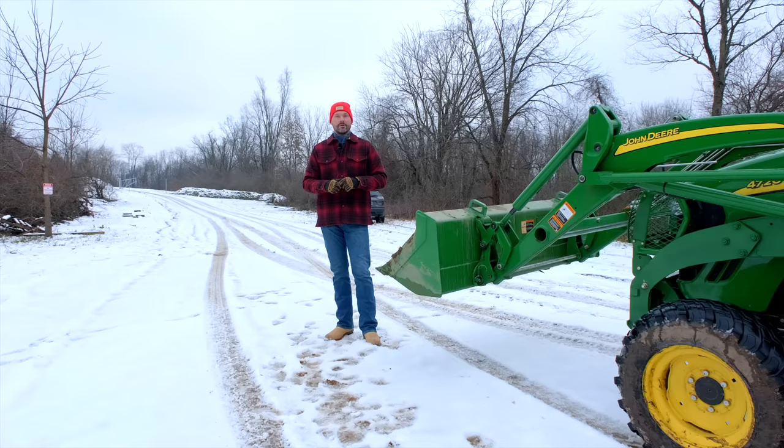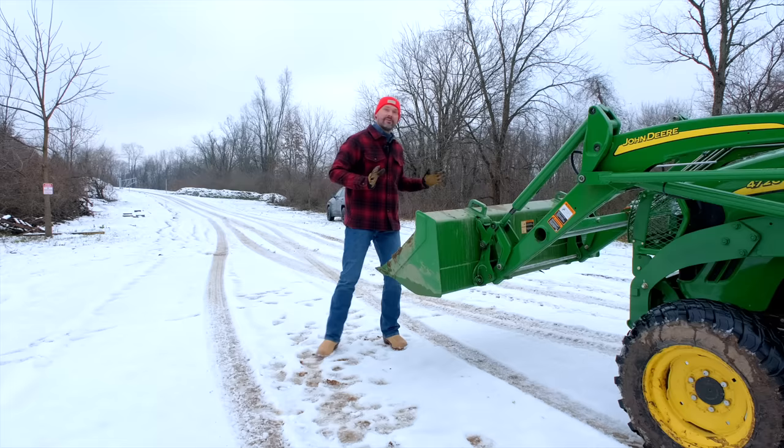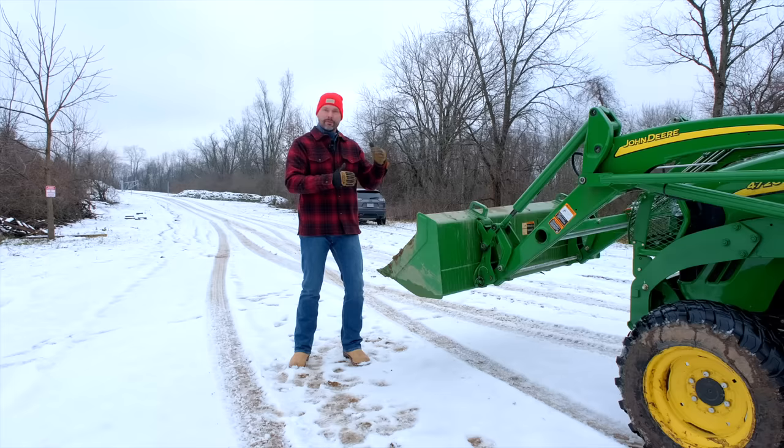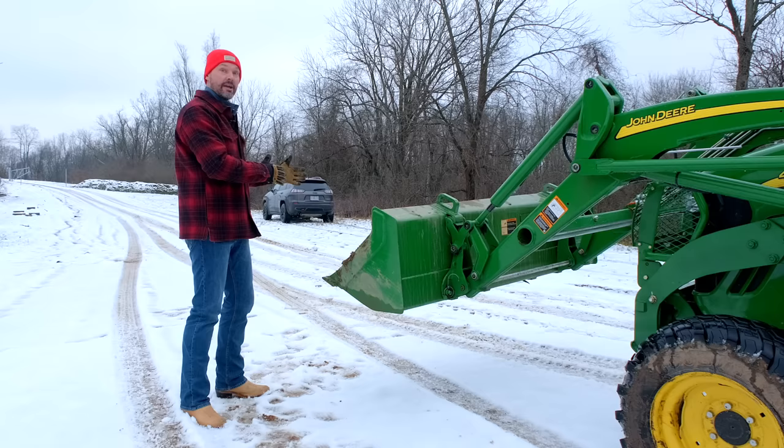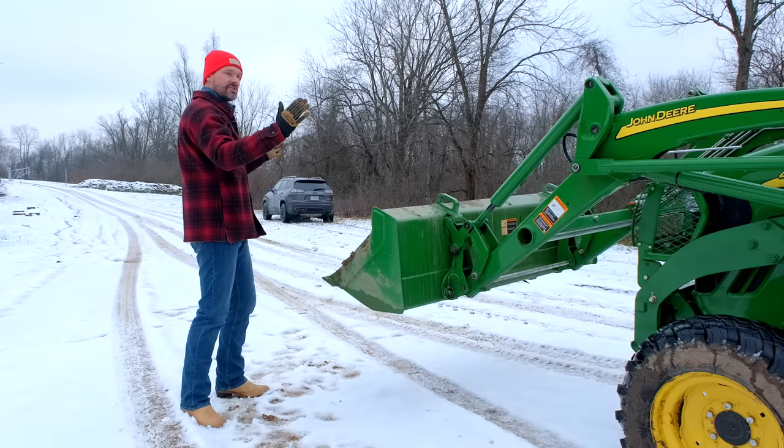That all sounds great and it works really well, but float does become a problem when you start to meet a lot of resistance. Once you have a big pile of dirt, a big pile of snow, or a big pile of branches that you're picking up with the grapple, at some point, and it's probably different for every tractor, you're going to reach a point, especially if you're in float, when the tractor almost wants to fold. The power still being generated by those rear drive tires is going to almost start to wheel up as the front can't go any further, or it's more challenging for the front to go further along. It just starts to fold up, and that's when those front tires come off